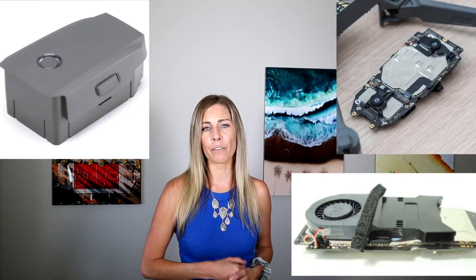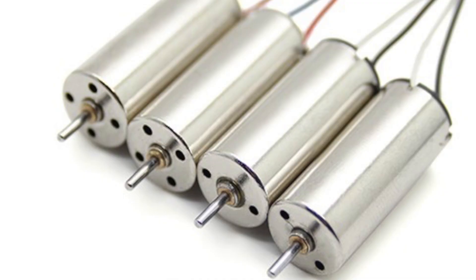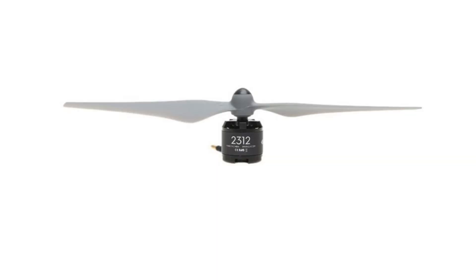If you have the money and you're comfortable sending it in to the manufacturer, then do that. Once you have checked your drone's batteries, main board, and circuitry, you have completed the check-through of the most dangerous and damage-susceptible parts of your drone. There are generally two types of motors that drones employ: brushed motors and brushless motors. Brushed motors, typically found on cheaper older drones, may be susceptible to water damage. However, most modern drones such as DJI drones employ brushless motors, which are generally resistant to water damage.